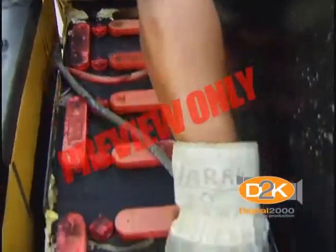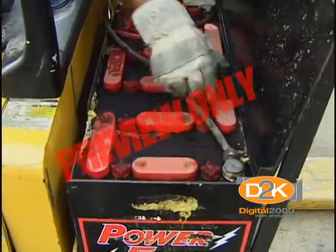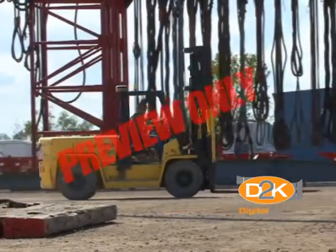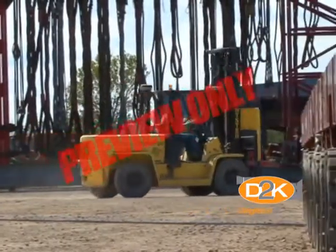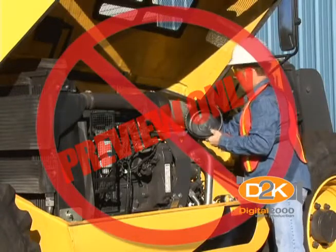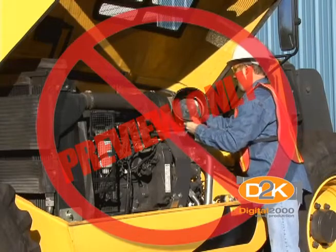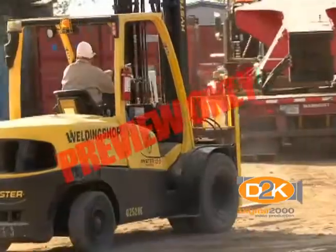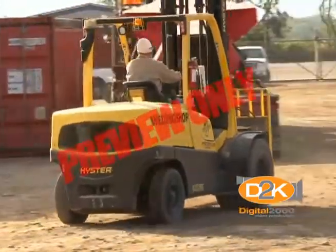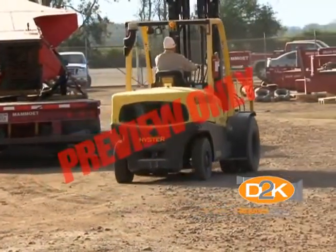Industrial trucks shall not be altered so that the relative positions of the various parts are different from what they were when originally received from the manufacturer, nor shall they be altered either by the addition of extra parts not provided by the manufacturer or by the elimination of any parts. Additional counterweighting of fork trucks shall not be done unless approved by the truck manufacturer.